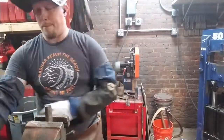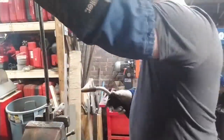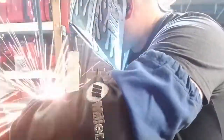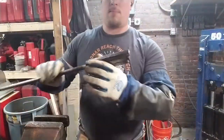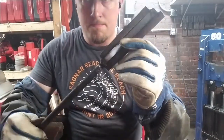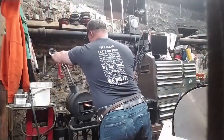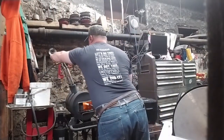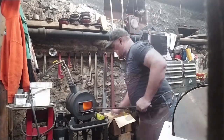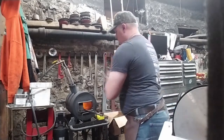Now I'm welding up the stack. I'm only doing tacking. Again, I'm not doing anything fancy like a zero atmosphere weld. Although that would probably make the weld more successful, it does make the process less illustrative for historically minded smiths. So what we're going to be working with is the situation that historic smiths were working with, where every weld seam had to be carefully monitored, and that'll be important later on.